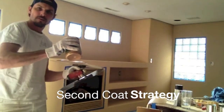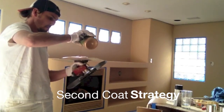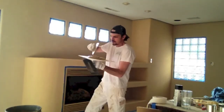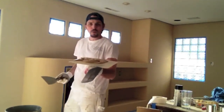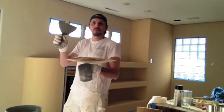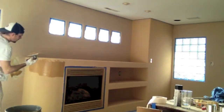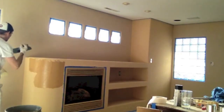My gold — just a very small pancake size amount. I give this a quick swirl. I don't want to swirl it too much and I don't want to work it too much on the wall, because the more I work it, the more it blends the gold. I want to get those really nice gold accents going. By doing a thinner layer, that will require less movement.